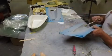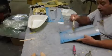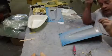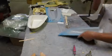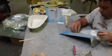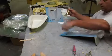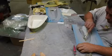This is going to be my seamless version — I have no seam tape. I'm just using two layers of six-ounce cloth, that's it, no more. They come out rigid enough, that's all you want. This side here I make an eighth inch short — that's where you want it. You just go right in here with your second layer. We're going to put no peel-ply on this; this is a wet layup. You want to keep your resin about as thin as you can get it.